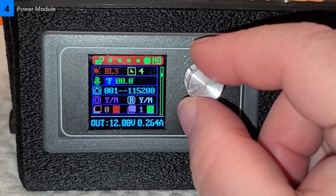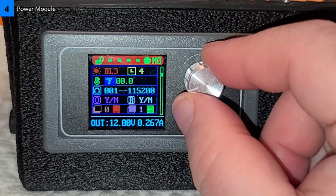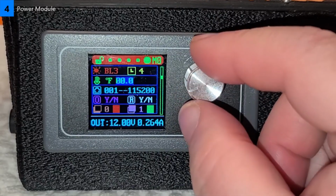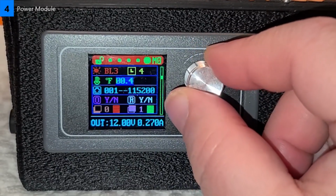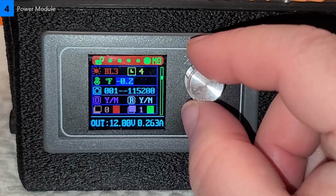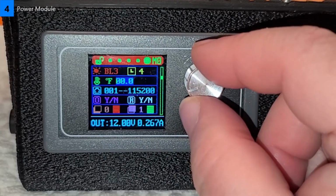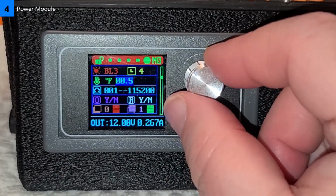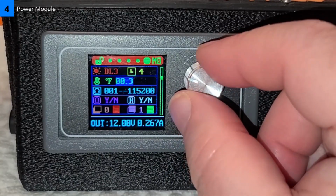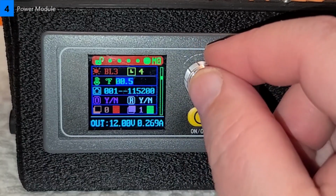Next is temperature value and offset. Here, you can select the default temperature scale to use with the tech bench, Fahrenheit or Celsius, and also specify a temperature deviation value when comparing the power module's temperature against the actual temperature in your work area. This is helpful if you find the power module's temperature reading is significantly different than the actual temperature in your work area, and adding a value here allows you to ensure that the temperature protection settings you specified on Screen 4 are accurately triggered.